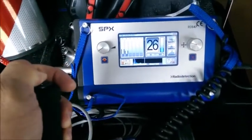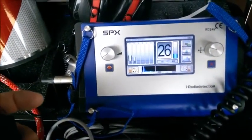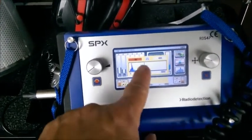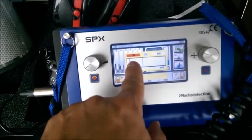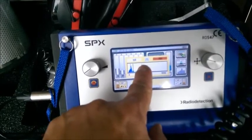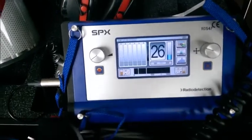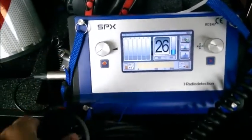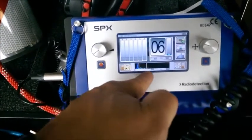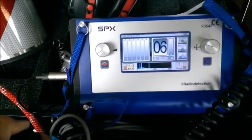Down below, you can see the different frequency noises coming in. If there's a noise that's coming and going, you know it's not a leak noise and you can filter it out by pushing on that and selecting your low pass filter — moving the cursor where you want it — then your high pass filter, moving the cursor, and zeroing in on the leak noise frequency. Push down below and the history is reset. Now the frequency ranges being listened to are visible, and the large blue wave, probably my voice, is being ignored.